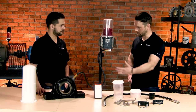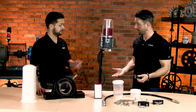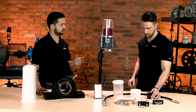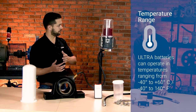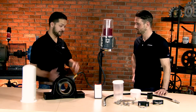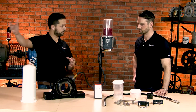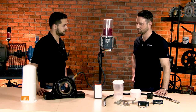And in difficult conditions it can operate in — this is the battery. There are two different options: alkaline or lithium batteries are already installed. Those two options give you an ability to operate in either cold or hot temperatures, down to negative 40 degrees or up to about 140 degrees Fahrenheit, or 60 degrees Celsius — pretty extreme. In addition to that, the robustness of the system and the ability for continuous pressure to get supplied to a component that could be several feet through the grease line itself makes it very versatile and a great option for really tough environments.